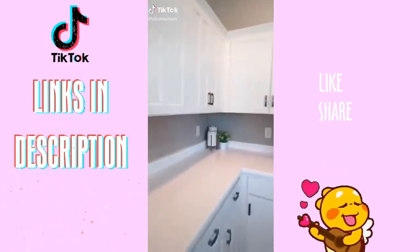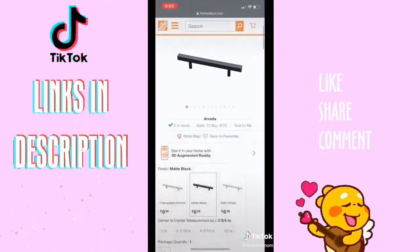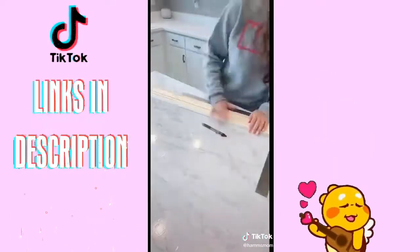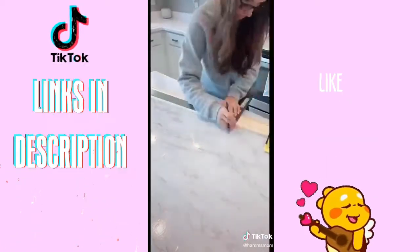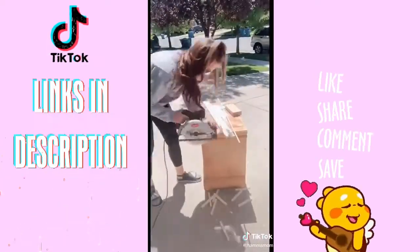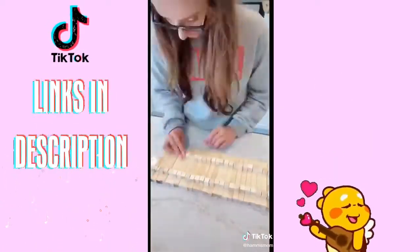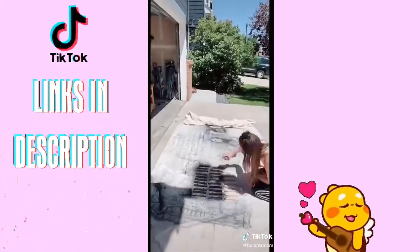I'm going to show you how to save hundreds of dollars when adding or replacing cabinet poles. The black farmhouse poles I wanted were $7 each. I bought square wooden dowels at Home Depot and square wooden blocks at Hobby Lobby, used a 40% off coupon. I wanted the poles to be 6 inches long each, so I lined up all the dowels and drew a line at 6 inches on each. I then used my circular saw to cut each piece — it's important that each piece is as straight as possible. I used wood glue to add a wooden cube one inch from the top and one inch from the bottom on each pole.